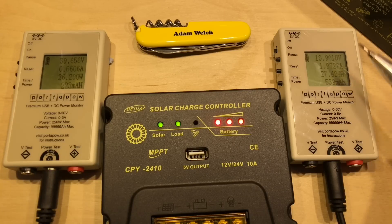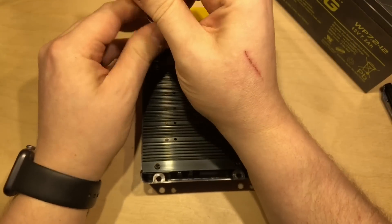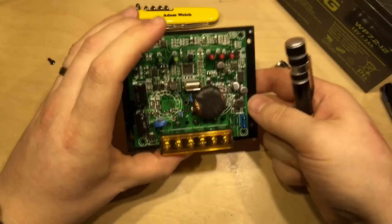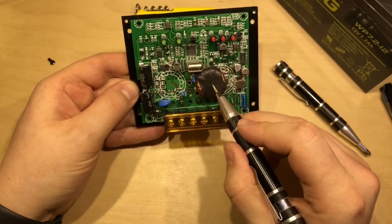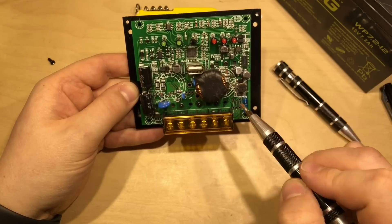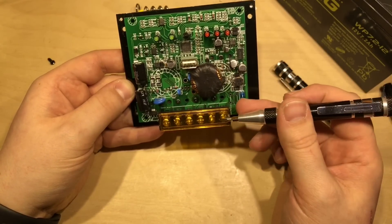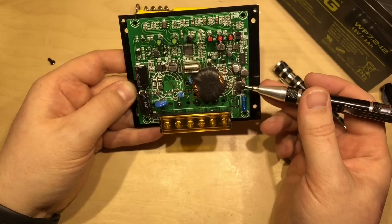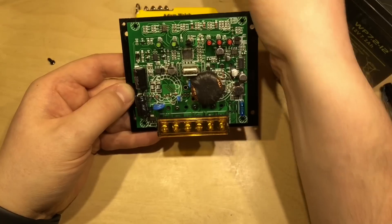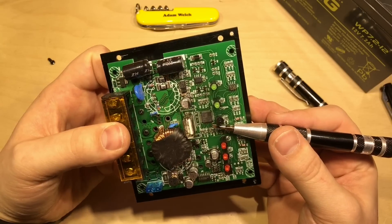I want to see inside, and it's the usual thing - just four screws on the back with the heatsink, one under the quality-control sticker. There we have it - and that's what we want to see: a decent-sized inductor. There's also a silk screen on the PCB for a second one; the 20-amp version presumably requires two inductors. There's a 15-amp fuse on the load output, another small inductor possibly for the 5-volt rail, and a thermistor at the top. The microcontroller is a Microchip UE 4811651.